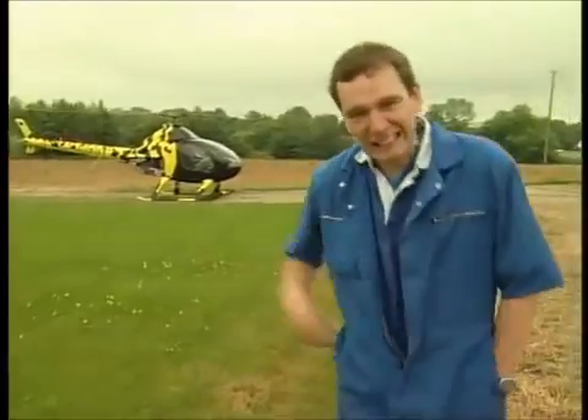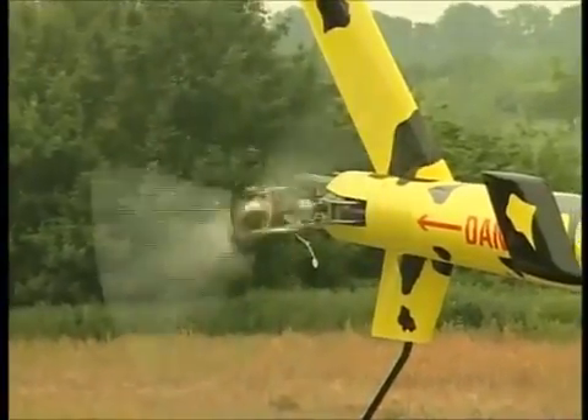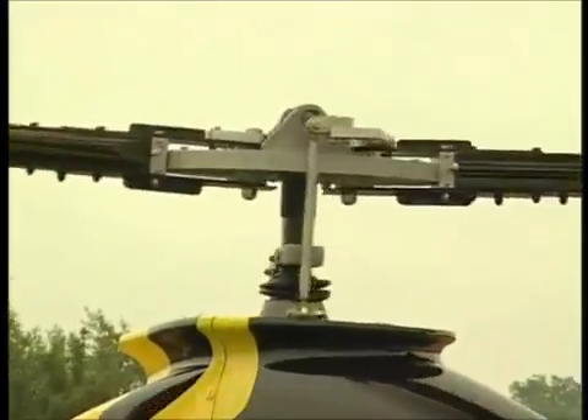That's the best toy ever! Put it on your Christmas list. How was that? I'm delighted to say that flew very, very nicely. However, there are just one or two things I think we need to adjust. The belts are starting to slip, they're going to need looking at, but that was to be expected. The cyclic is giving me about a 2.5 inch starboard bias - easily taken out, but it's going to need a little bit of correction up at the rotor head on the controls.